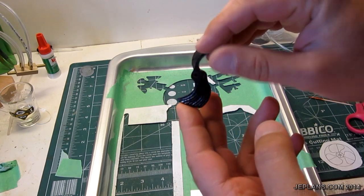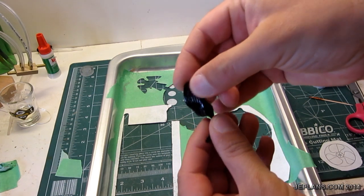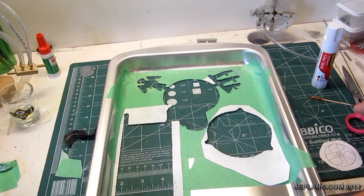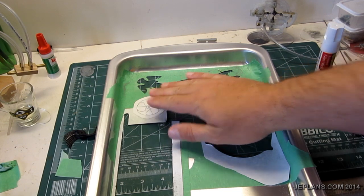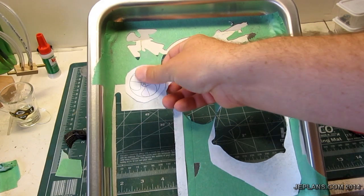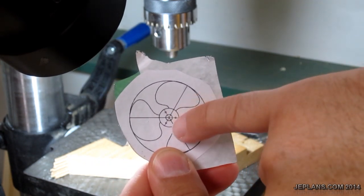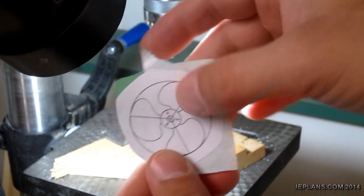I wanted to try a different design for the prop on the boat. This one works certainly, not the smoothest. I could have sanded that more once I stack-glued the pieces of CD that I made it out of. Nonetheless, I'm going to try and make a small aluminum prop. Just use my same bake pan that I use for a variety of other projects. Cut that out, try to bend it to the right curvature by hand. The center will be drilled out to match the axle I'm using, which is 1/8. I'm going to drill a few small holes around it for the glue to come through when I mount it to the next piece, just to help hold it.